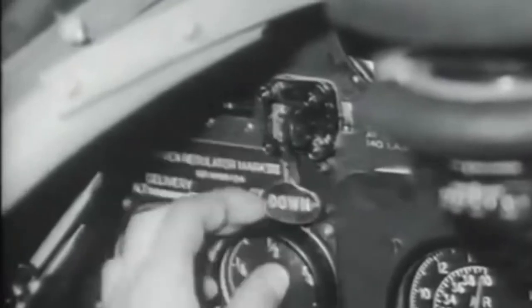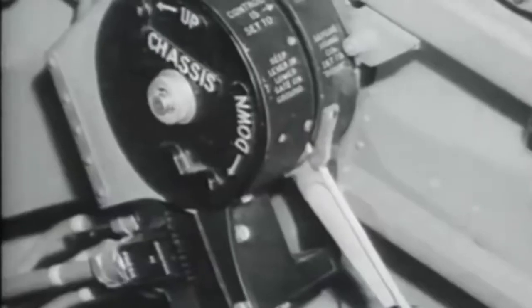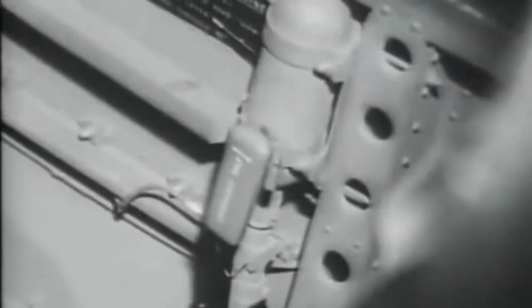The Spitfire One's landing flaps, like the brakes, are operated by compressed air, and can only be either fully down or up. The wheels are normally retracted by hydraulic power from an engine-driven pump, but this lever releases an emergency supply of carbon dioxide to the undercarriage.